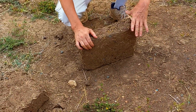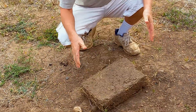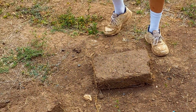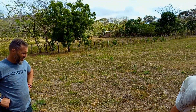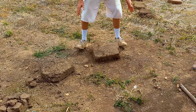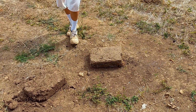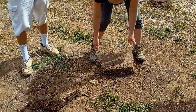This was an experiment with the bahareque mixture, which is mostly straw, and I'm really happy with it — it's almost as strong, I think. It's certainly heavy. I'd like to try it without so much clay, because this is really still heavy — I wanted to try to make a brick that's lighter, actually lighter to carry. But this is still super strong and it's holding up really well. With the rain and everything it'll end up like this, but this is a way you can test your recipes before you actually start building.